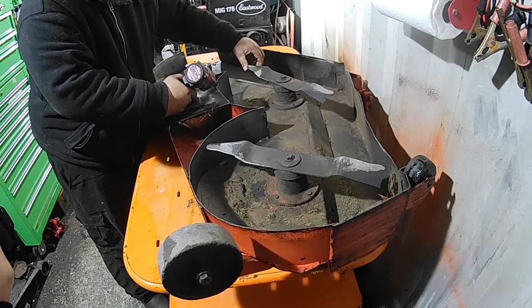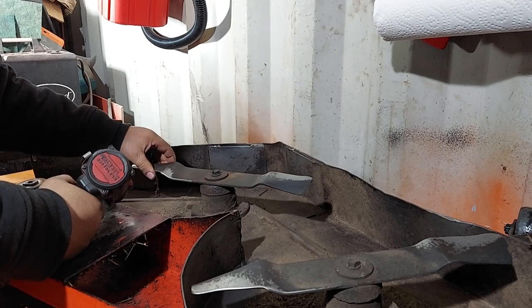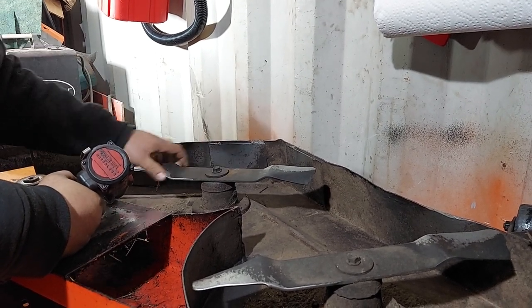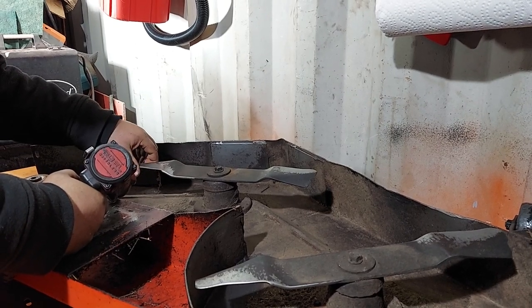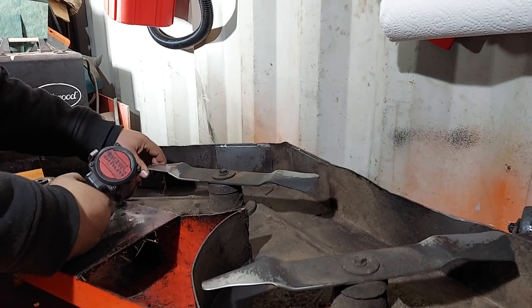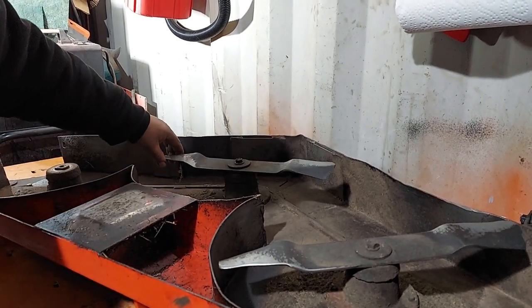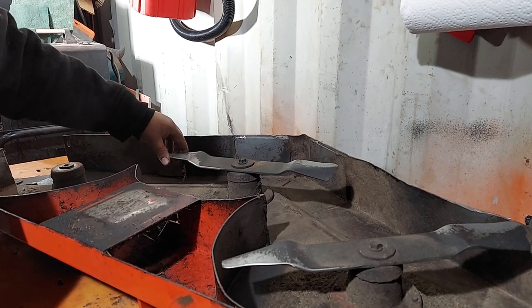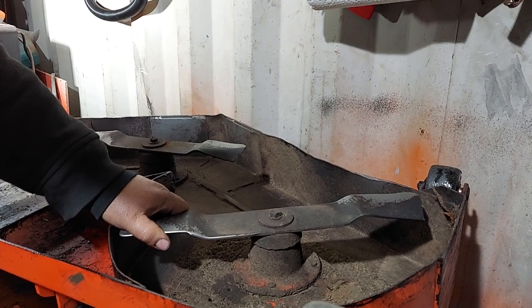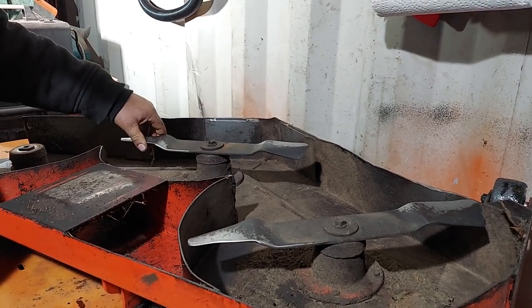This center spindle has got some issues for sure — it could be a worn blade adapter or worn blade, the holes can be stripped out, and it's not threading down properly. That's very dangerous at the speed it's going around — it could come off and hurt somebody or the machine. There should be no movement when these things are tight at all. This one has some play; it feels more like bearing play.